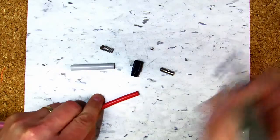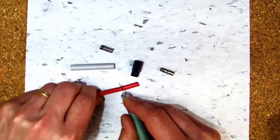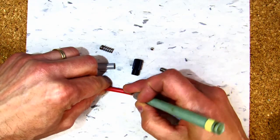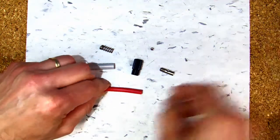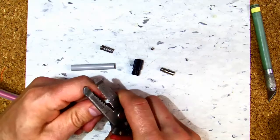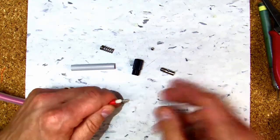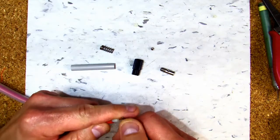First, take the static bar cable that will be used and make room for the connector by removing part of the protective jacket. Score the insulation at around a half inch and pull the red material off. Then cut off around two thirds of the white insulation to expose the wire. Since the set screw will clamp this wire, we recommend doubling it over for strength.